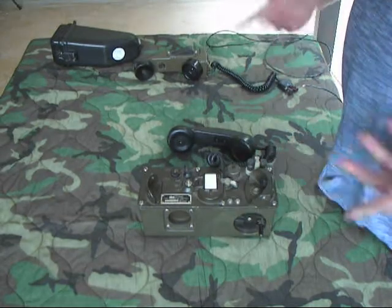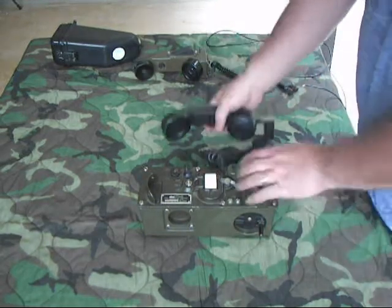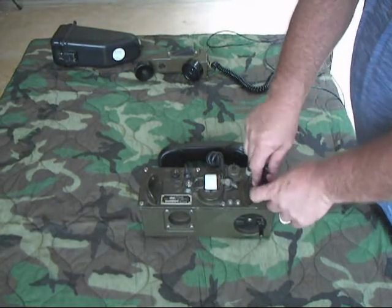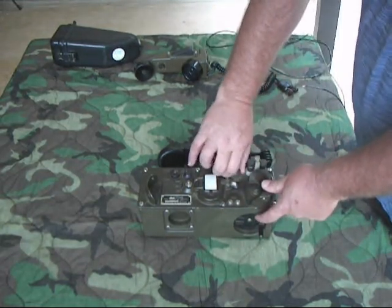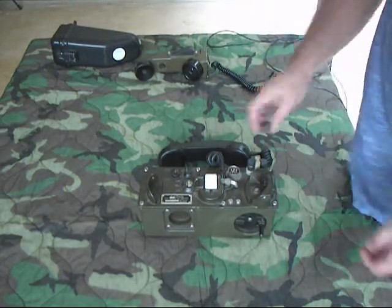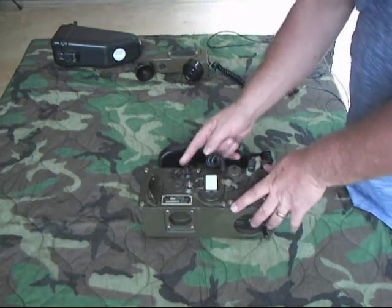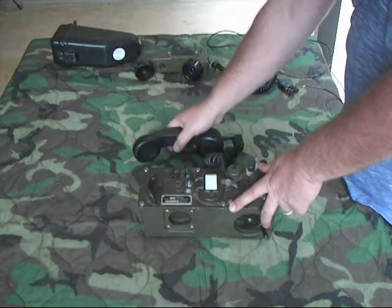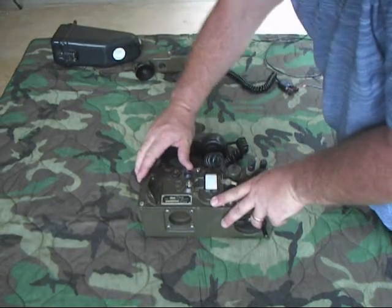And what these buttons do, basically they allow you to pull power from the telephone switch, which you're probably not going to do because you don't have a powered switch. These two points right here, these screws, allow you to hook a battery pack to it on the outside. If you have a 3-volt battery pack, you can hook it up on there to run it. These are unique because they had this right here that allowed you to connect either another headset or handset there so you could be hands-free or another person could listen to what was going on with the call. This switch right here then decided whether the push-to-talk was going to be on the handset internally or if it was going to be on the headset somebody was wearing. Right now we have it set on internal.